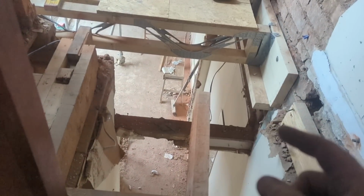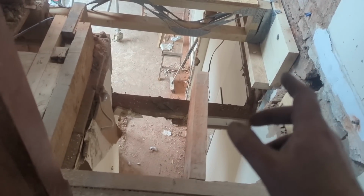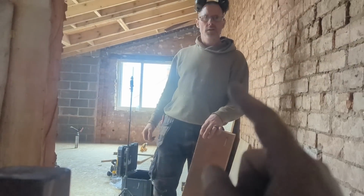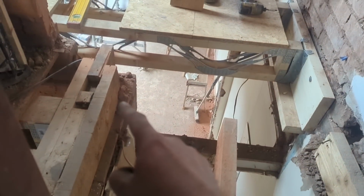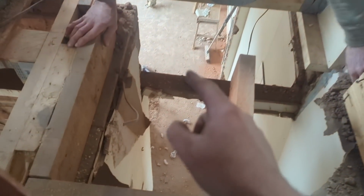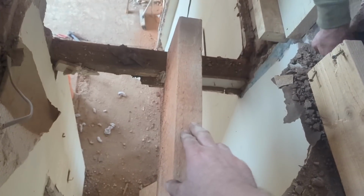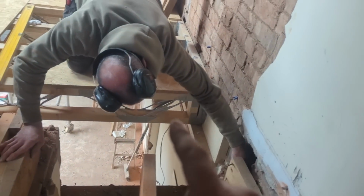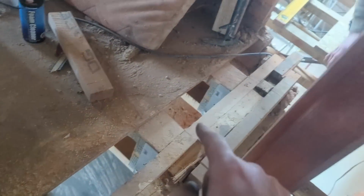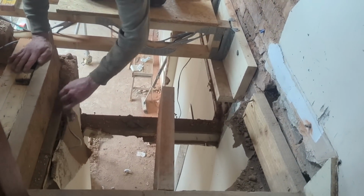Right, well this is just an exercise now, because I can forget things quickly. When I did all this, I remember now, it was all done temporarily in order to be fettled and fixed by the main man here. It was just a couple of screws holding this bit in there, across there, which was high. So we've notched it out, or Rich has, so it sits back on this wall and on that wall a little bit lower, which will pull them lower and bring it perfectly level with what we've got over there. We've just stuck the level from this joist to that joist, and we are absolutely spot on, as we knew we were, because that's what the laser said.